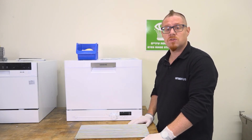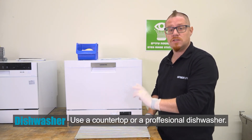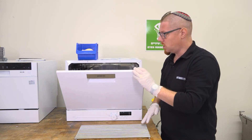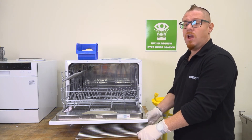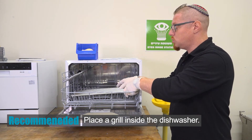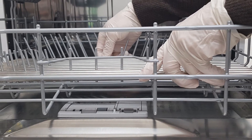Where the geometry allows, we recommend using a countertop dishwasher like this, or a more professional dishwasher that lets you more precisely define the cycle and temperature times and durations. With a dishwasher, you typically have a tray suitable for cutlery and crockery — we recommend using a grill like this, placing it into your dishwasher base making sure it's level, to provide a surface for the parts you've printed.